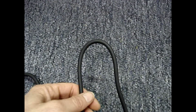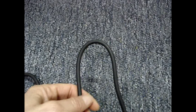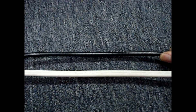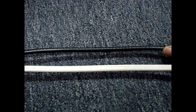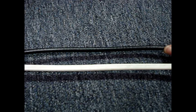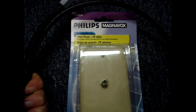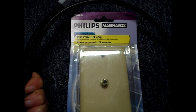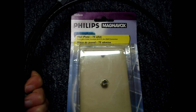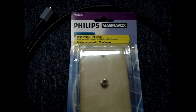A few other things that can cause trouble: don't kink, pinch, or make real hard bends in the cable. Don't run coaxial cable next to or parallel with AC voltage cables. All the cable and connectors on the circuit must match — in other words, you can't mix 50 ohm cable with 75 ohm cable.